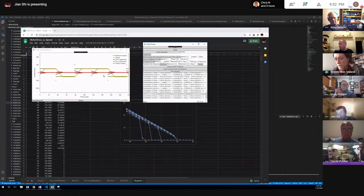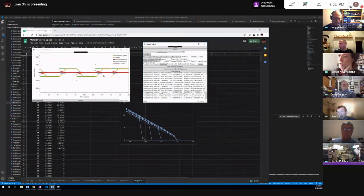Yeah, and in fact, I've got a tank style robot with four wheels, but I've only got encoders on the front set of wheels, and the motors are wired in parallel. So I only have two controllers, each controller running two motors. I had tried a tank robot with treads, but I gave up on that because my robot's too heavy for it.